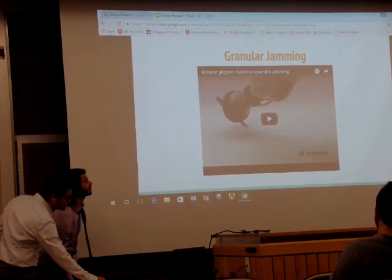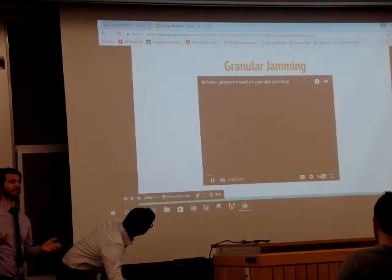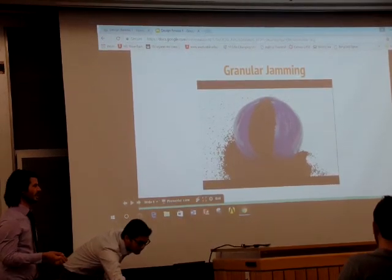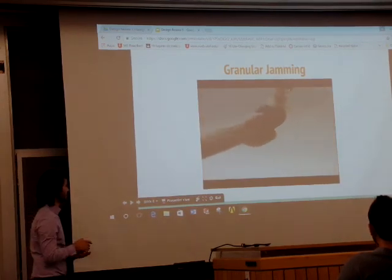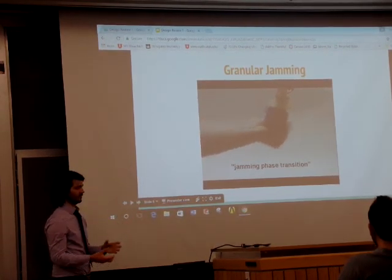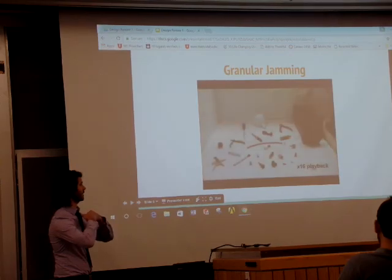The main mechanism by which we propose this design to work is granular jamming. The most common example most people see is vacuum-packed coffee: you remove air from the package and it becomes a fixed rigid object. This is being used in robotic arms now. Basically, you have a rubber balloon full of coffee grains - you remove the air and all the grains lock in place and you have a rigid body.